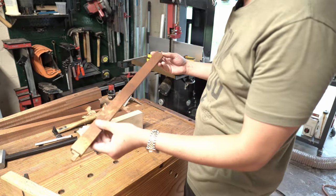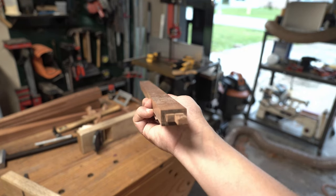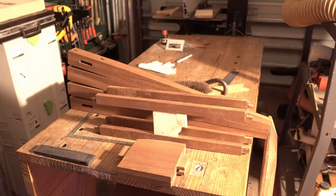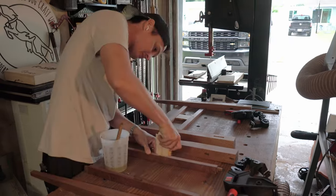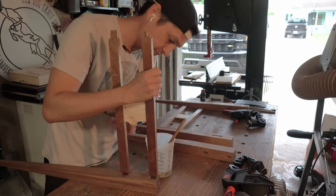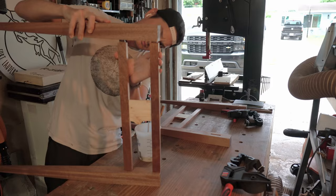I've been spending a lot of time working with my planes to try and get that gorgeous planed finish that kanna is known for. I've been drifting away from hard wax oils and urethanes because I want to really highlight the wood — you can certainly see the difference in these components with the gleam from the sheared surface and the chatoyance that it brings out.